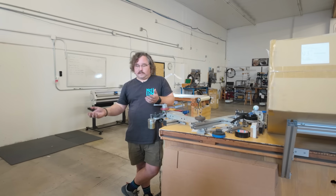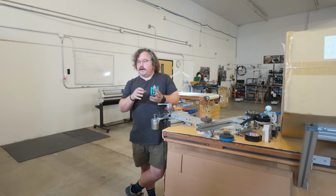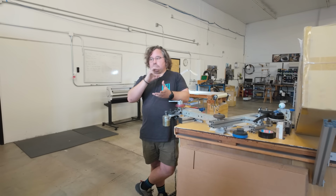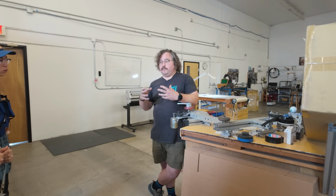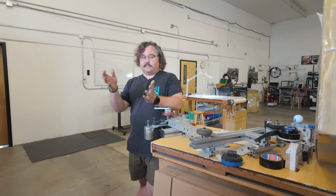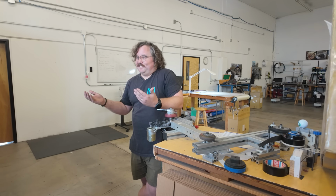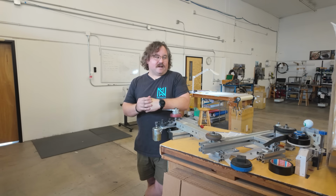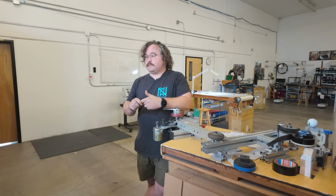Like, they went from 24 tooth to 48 tooth a while back now, in the mid-2000s, and that was just a drive ring change. So you could take your hub that was 25, 30 years old and change it to a modern spec. You can change out the axles on it to make it relevant to any bike nowadays, or the opposite, you can retrofit your modern hub. It's one of the core principles of our businesses, just making sure that we have things that last forever.